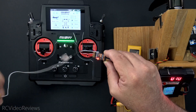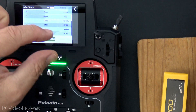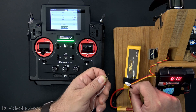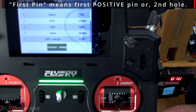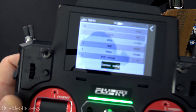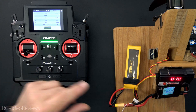The first sensor we'll check out is the BVD sensor itself — single wire, solder it to a pad on the receiver, and you're ready to go. I'll bring up the sensor list on the radio and scroll to the bottom and you can see BVD voltage right there on the screen. You take your positive lead and connect it to one of your balance leads on your battery. If I connect to the very first pin, we should get one cell worth of voltage — 3.8 volts is what's on the screen. And if you want to get the entire battery voltage, you connect to the very last pin, which gives you the voltage for the entire pack — 11.4 volts for this 3-cell battery. Remember, this sensor will take up to 70 volts. I really like that feature.